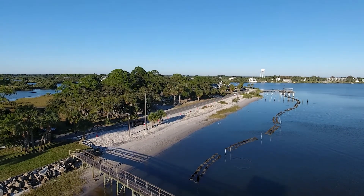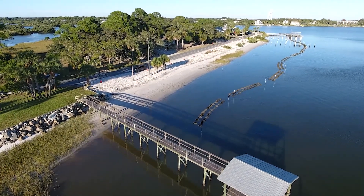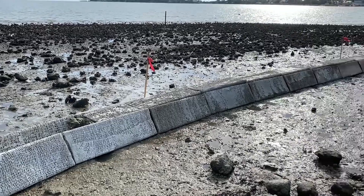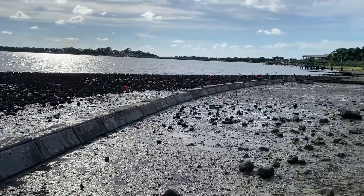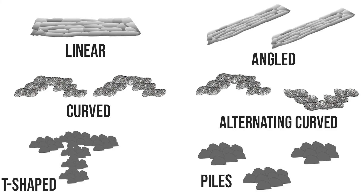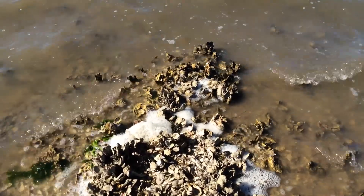The overall length of a breakwater along the shoreline will also determine the number of gaps required to allow wildlife passage. The minimum standard for permitting in Florida is to allow at least one 5-foot wide gap at least every 75 feet of breakwater. However, gaps may need to be more frequent depending on the conditions at the site. Breakwaters can take many shapes including linear, curved, alternating curved, T-shaped, angled, haphazard piles such as when using rocks, or a combination of these. Whatever the shape, the breakwater should be designed and placed to intercept the prevailing incoming wind and wave energy at the site. It is also a bonus if the breakwaters mimic the shapes of nearby natural features such as oyster reefs or sandbars.